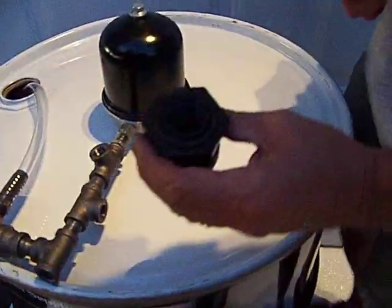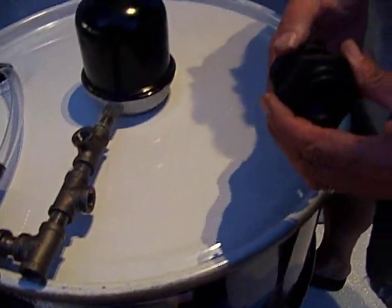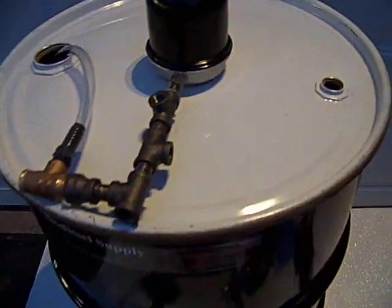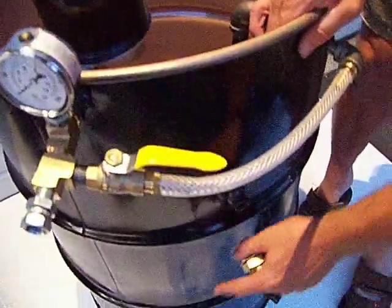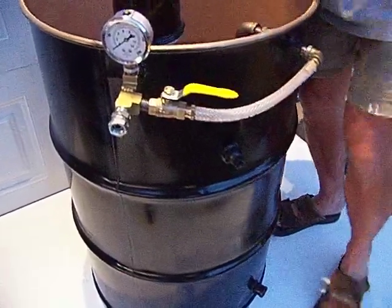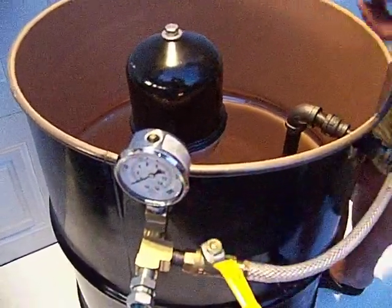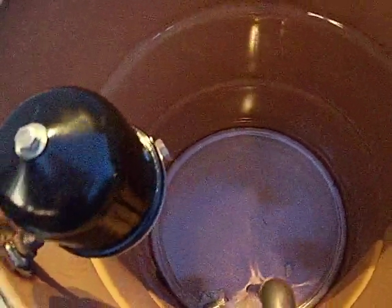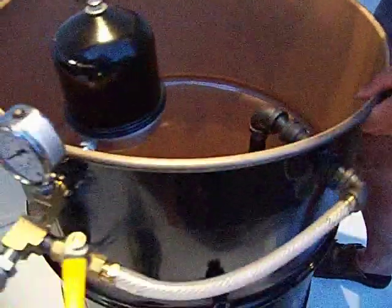This is an excellent way if you don't have a welder. Instead of having welded fittings on, these work great. Here's another way: you take 3/8-inch couplings, weld them in. You take 3/4-inch supplies, and we weld a fitting on for a thermometer. I like this one, especially if you're using the bypass as an adjustment on the pressure. Because whatever's bypassed is all dirty oil — it goes straight to the bottom. It's probably 6 inches from the supply to the pump.